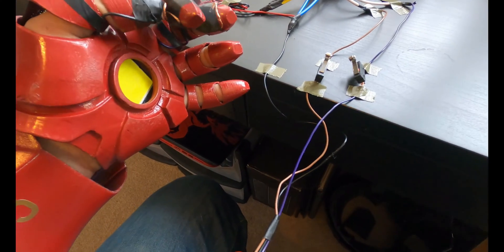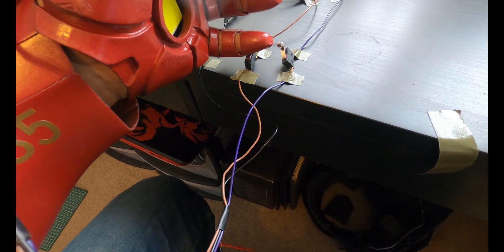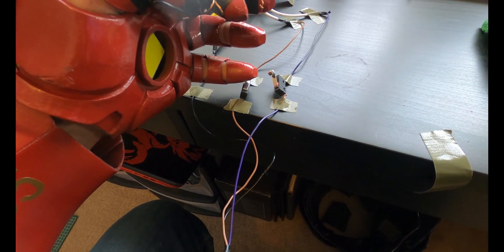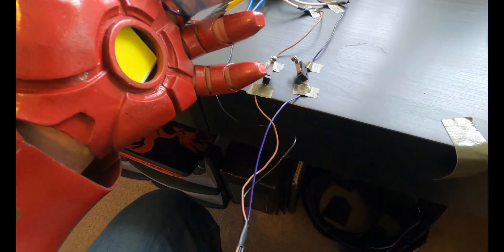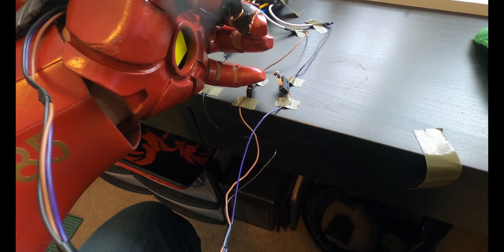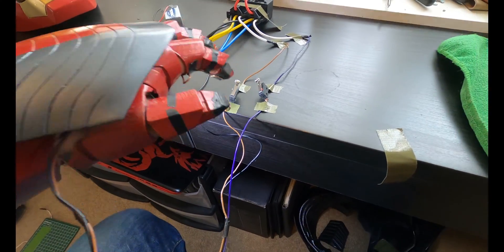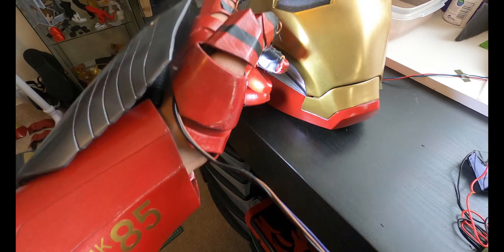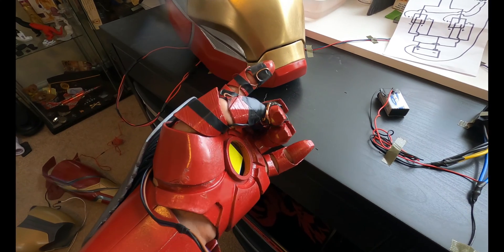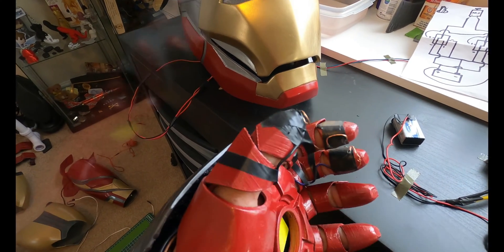If I touch these you'll hear the motor going. So I hold the trigger on the brown wire — nothing happens. This interrupts that. But the way it's wired up, the other trigger, the other circuit, will still work and close no matter what. I'm going to place these inside the helmet, moved over where the hinges are, so once the helmet is fully closed one switch will trigger and that circuit won't work anymore, but the opening circuit still will — and vice versa. That tells the motors to stop so I don't burn them out.